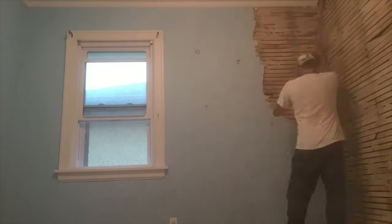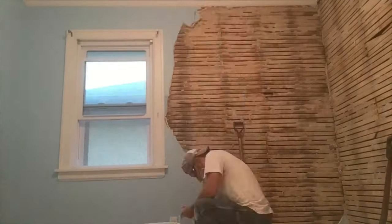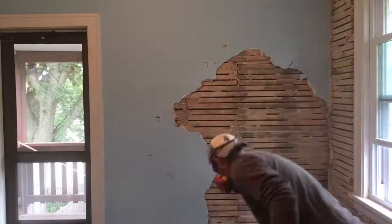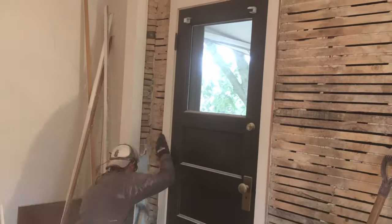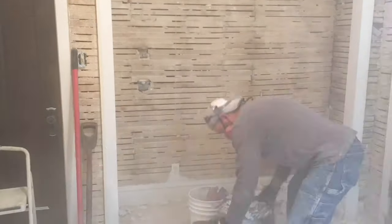To break up the hard work of bagging, I started ripping the wall in sections and then taking breaks to bag them, which made the process a lot easier — though it's not as gratifying as knocking a wall down in three or four minutes. On another wall, I moved away from the tile scraper and used a hammer and a small pry bar. I was doing the back wall that attaches to the bathroom, so I was extra careful there.